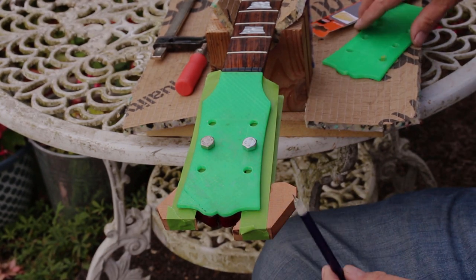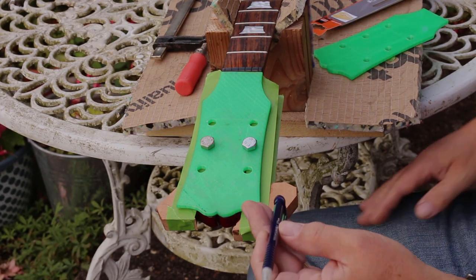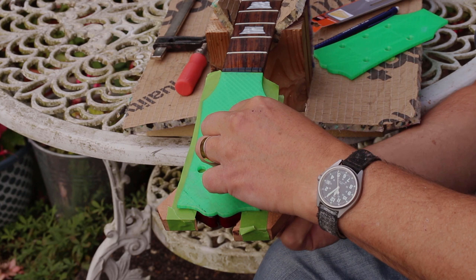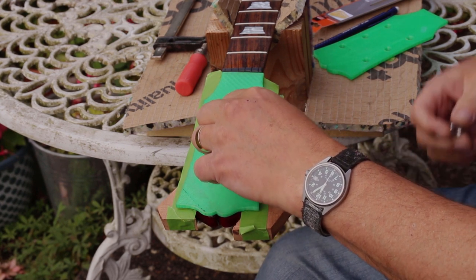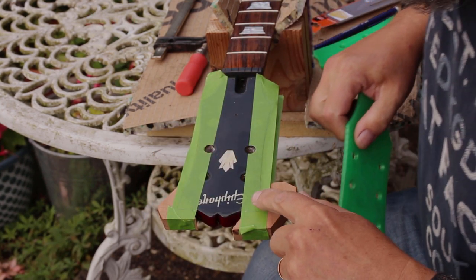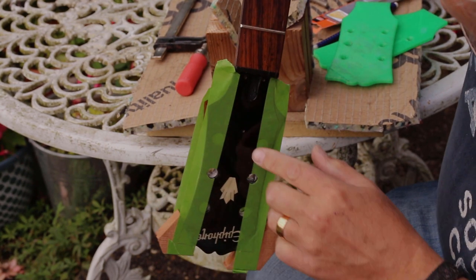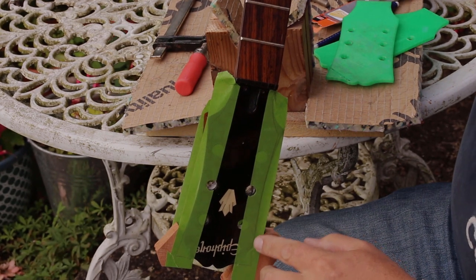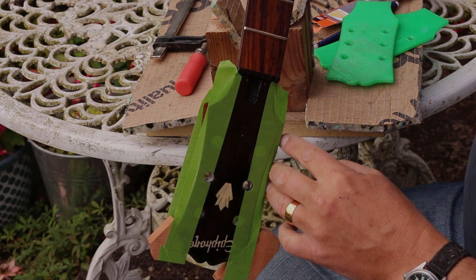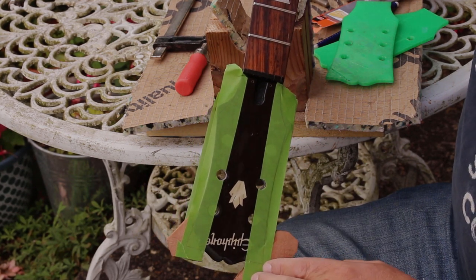Also, the pencil I'm using is a mechanical pencil or a propelling pencil — so it's always fairly sharp. This one is a 0.7mm, but it does mean you'll get a fairly narrow marking line. Looking at that, if that template is to be believed, it's pretty well following the outer part here — it's only really starting to come in from the narrowest point. I'll take a view on these areas: if I think it needs it aesthetically, I will take a file to them or a block of sandpaper.